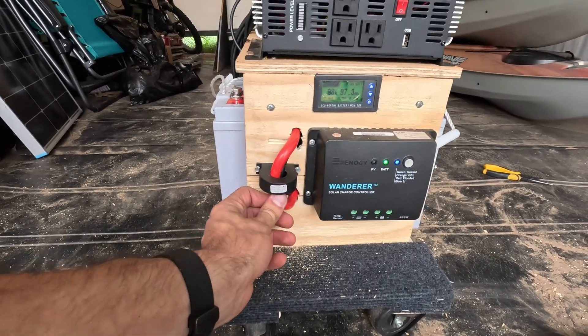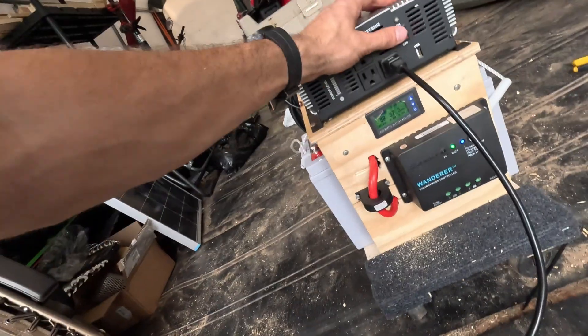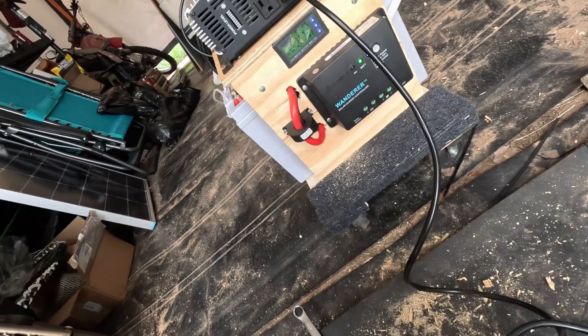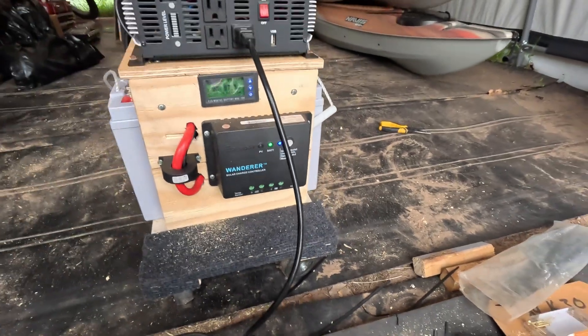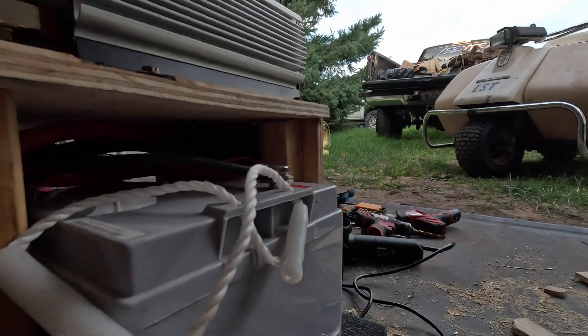There's an arrow here. So I figured if it's charging, that should be positive, and I think that's how I hooked it up. We'll test it. These are like two wires going different directions — one's adding and one's subtracting, or should be anyways. But on here it should say like minus whatever. Why is this turning on? Okay, so it's backwards. You've got to be kidding me. This took forever to layer everything up. Look at that rat's nest in there — you're telling me I got to redo this? That's not cool. Well, I guess I'll redo it then. I'll do a time lapse this time.